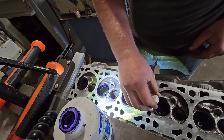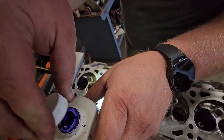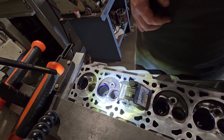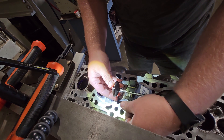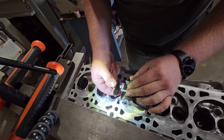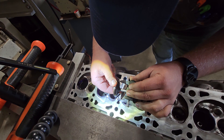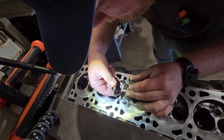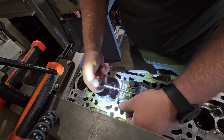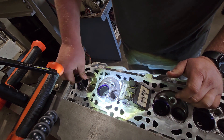I can know if I need to go deeper or anything like that. I'm setting up to know where to set the tool for my three-angle cutter — this is kind of like a transfer gauge. I put the point not on the edge of the valve hat but a little bit off of it, about 60 to 80 thousandths. You don't want it right on the edge — you want it a little bit in on the valve. I'll explain that in more detail in future videos.